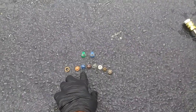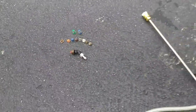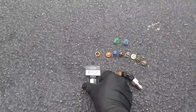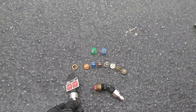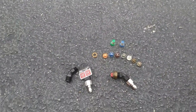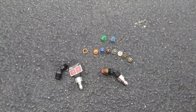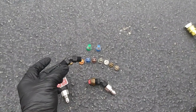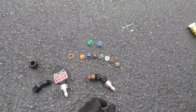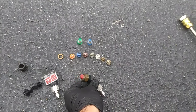So you've got some filters here and some heads, and what I did was make this little ingenious adapter. I went to Northern Tool and got a stainless steel quarter-inch adapter, then I went online to Spray Smarter and got that little adapter for T-jets — it's a quarter-inch adapter with a curved tip. You can take any one of the heads, put this on, assemble it, and you end up with this. Put a nozzle on it — there's also a filter in there to keep the nozzle from getting clogged.